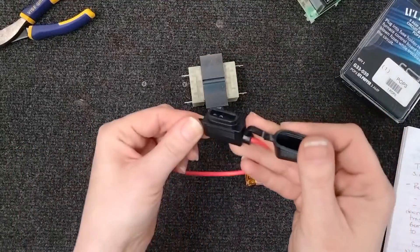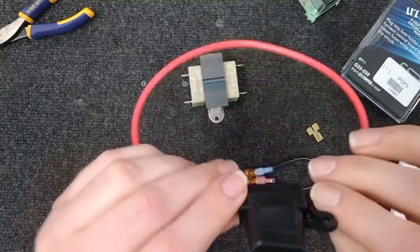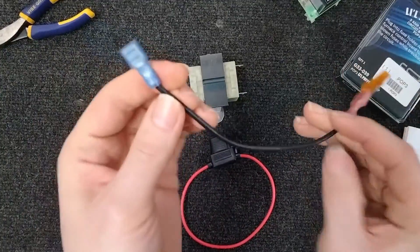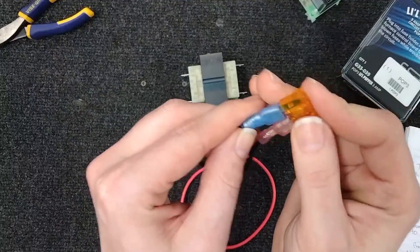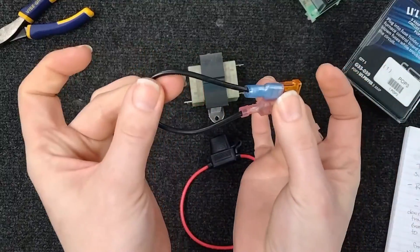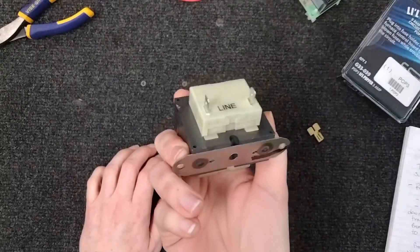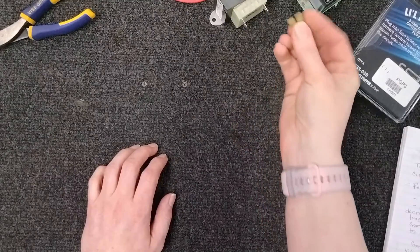We actually have these here — they're pretty handy, they look professional, and completely insulated. Just something simple like this that you can make where you just take the female terminals and crimp them onto — it doesn't need to be anything crazy — maybe a 14 to 16 gauge wire, totally fine. Just clip those on there and wire it in. Hopefully this helps give you guys an idea of what you're looking for when a transformer goes bad and how it functions within your unit. Thank you so much for joining us today, and I hope you have a great rest of your week.